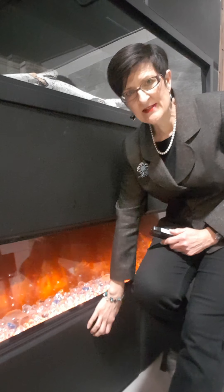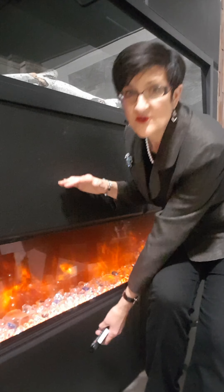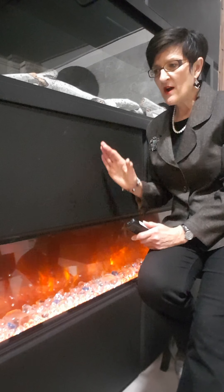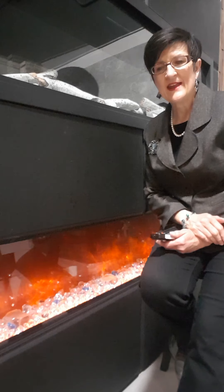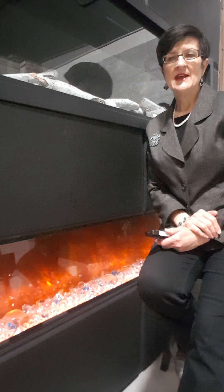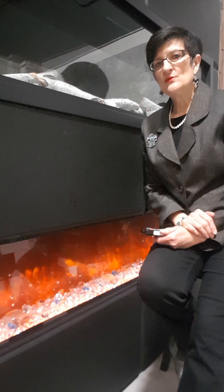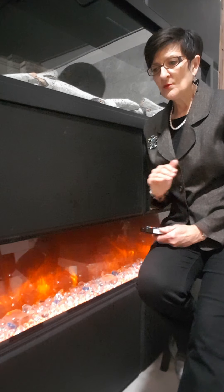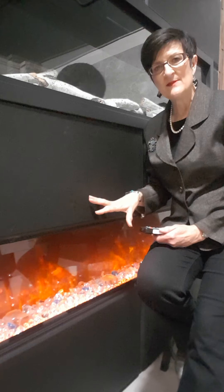There's metal behind here on both sides. The box itself is much higher than what you're seeing in this window. My wall materials have come down over the firebox, and that requires a different type of planning and framing to get this installed, tested, and ready before the wall is closed. So it's much more like a gas fireplace — it's really truly built in.